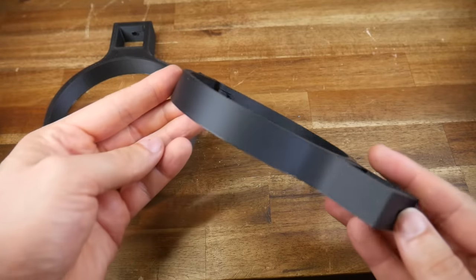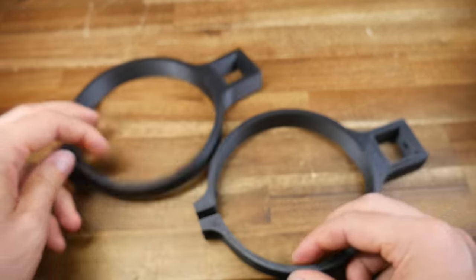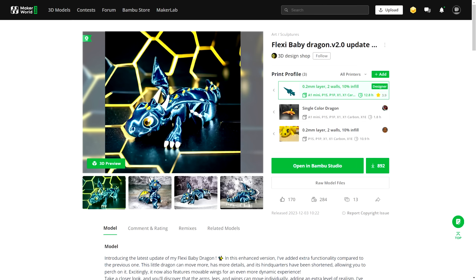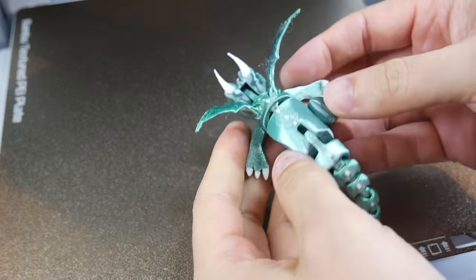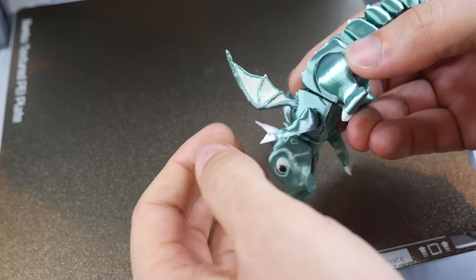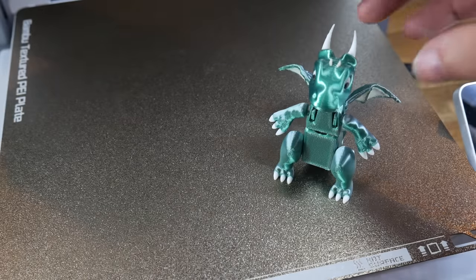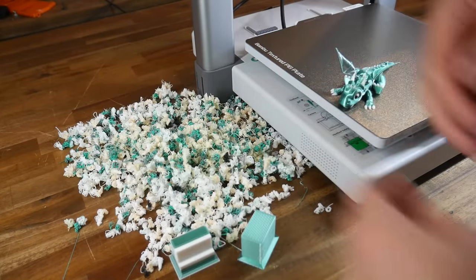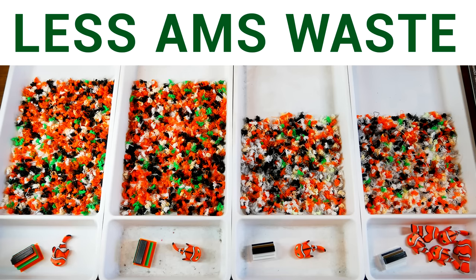For PETG, I printed more of my chicken feeder brackets. Overall they look amazingly clean, but in the same areas on each print they suffer from the same loose extrusion we saw on the black fan shroud — I've asked Bamboo Lab if they know what this might be and I'll post the answer in a pinned comment. I picked this Flexi Baby Dragon from 3D Design Shop to show one of the strengths but also the weaknesses of the AMS Lite system. It's quite a challenging print — many small segments, four colours, with some segments of the wings being very narrow and subject to stringing as well as inadequate part cooling. On balance I'd still describe this as an impressive print, though it took seven and a half hours and produced a lot of waste filament to purge the single nozzle. Multicolor printing is reliable, but at a cost.